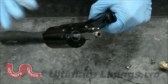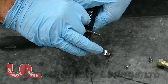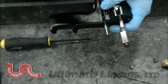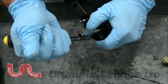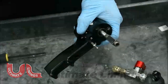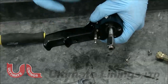This is your mixing chamber — it's an O-1, meaning one gallon per minute. These orifices get clogged up after a certain amount of time. The best thing to do is slightly warm it with a propane torch, then use a paper clip to poke the orifices — not the drill bit, because the drill bit will scar the chamfer ends. Poke it in from the front, apply compressed air, and put your fingers in front to feel the air. Then hold the gun up to the light and look right through the orifice — you should be able to see as clear as day. If not, it's still dirty — repeat with paper clip, warm it up, and compressed air again.